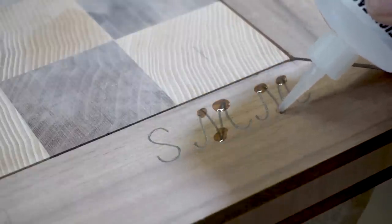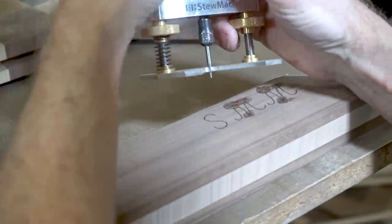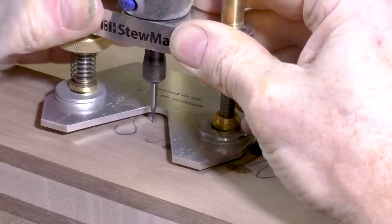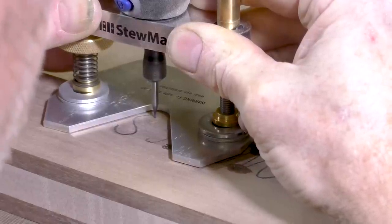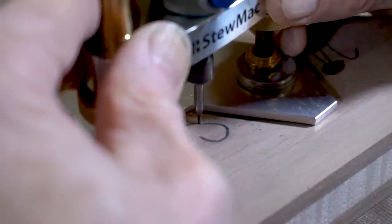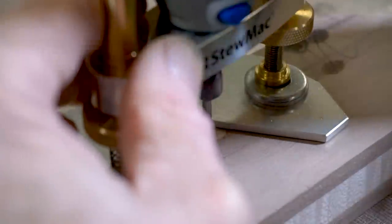I'm not sure if it's going to work but I think it's better than doing nothing. The copper is about 0.85 to 0.9 millimeters thick and I have a router bit that's 0.75 millimeters thick — just a little bit thinner than the copper — to give it a nice tight fit. Since the router bit has a 1/8 inch shank and my router doesn't have a collet that small, I'm going to use my Dremel tool attached to a router base for a Dremel. I have the Dremel tool set on a medium speed and I'm going to proceed very carefully. The video right now is going at about two and a half times the normal speed.